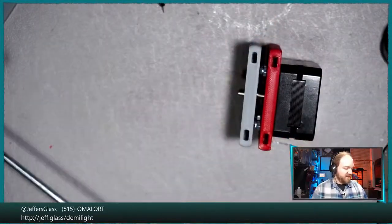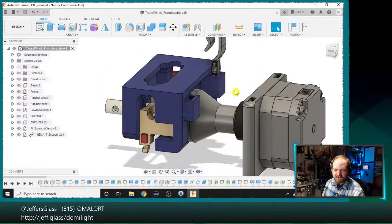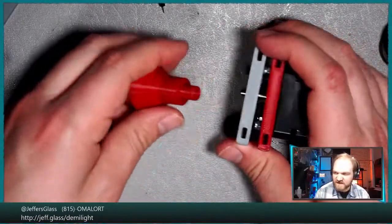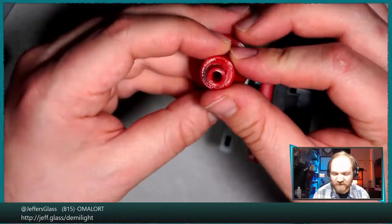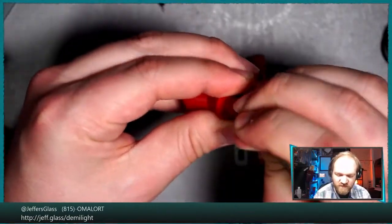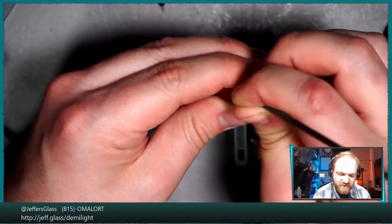It'll sit right in front. And that bearing block is there to support what have we been calling this? The handle wheel? That was our working name for it, although it doesn't have anything to do with a handle anymore. Maybe the pressure wheel? Pressure wheel seems plausible. So that's this guy. This takes the place of what was our hand crank mechanism on the hand crank version of the winch. This is now the stepper motor powered version. You can see there's a little bit of a D shape in that hole there. And I think one of the things I'm going to do is give this a real quick file out and lubricate, because part of the action of this winch, as we've looked at before, is that this needs to be able to translate forward and backward.